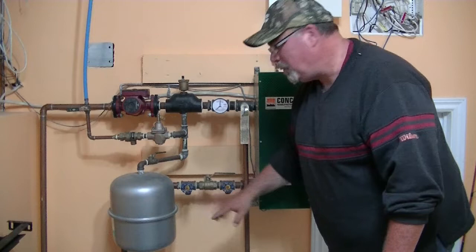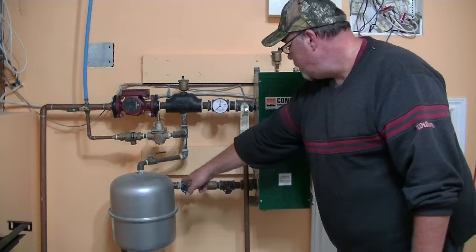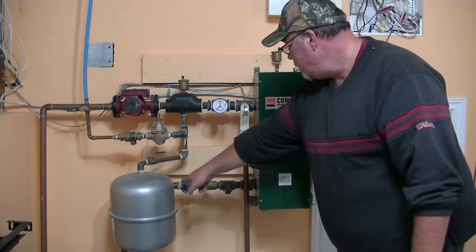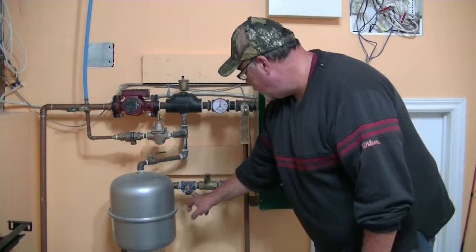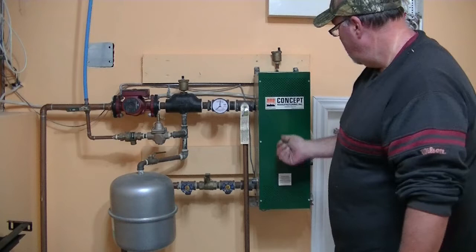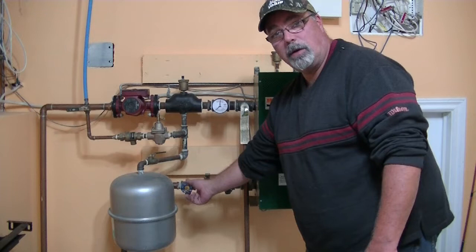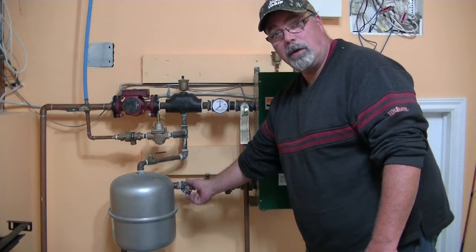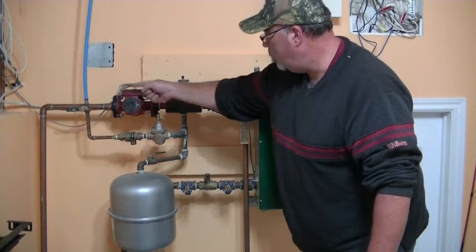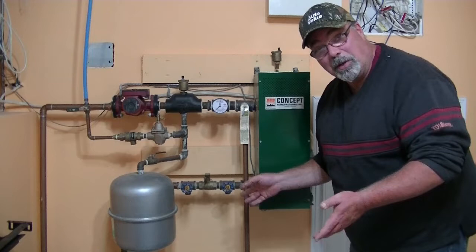That took me a few minutes to figure out — there are two of these valves here, with a shut-off valve in between. So we're going to use that so that we're not putting the sludgy crap into the boiler. The fresh water is going to cycle through the system and we're going to hook up our hose here so that it'll send it out to the street. We'll do it through all the valves. But then we still have the boiler to flush out as well. In that case, we're going to disconnect it here, close this one off, disconnect it, then disconnect our hose to this one. Then we're going to turn on the fresh water again — the water's not going to go through the manifolds because we've got them shut off. It's going to force the water through the outlet into the boiler and back-flush it. At least that's my theory. Hose is on, it's good and tight. I've got it run out to the street.